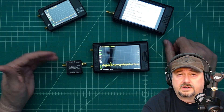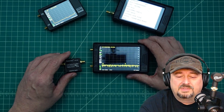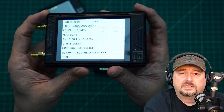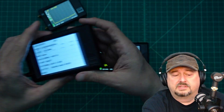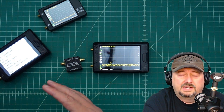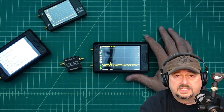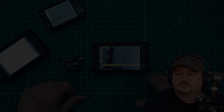For a signal source, I could use one of my signal generators, but the Tiny SA Ultra Plus goes up to around 7 GHz and I don't have a signal generator that produces signals that high. Instead, I'll use the signal generator function on the Tiny SA Ultra, which goes up to about 5.4 GHz. That way we can characterize the gain at a lower frequency around 20 MHz and a higher frequency around 5 GHz. The point is to demonstrate the capability and show you how you can do this yourself.